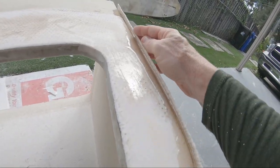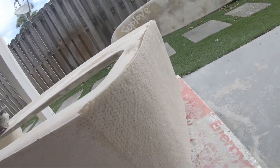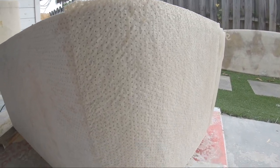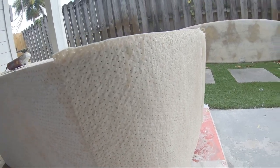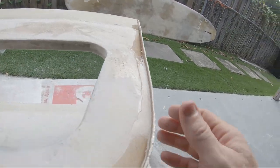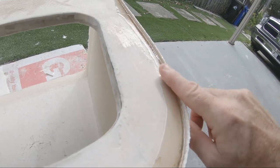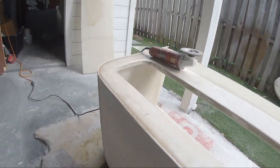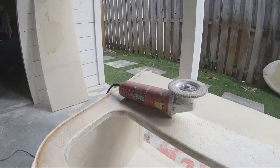The next day I finished putting the core mat on the side. You can see it makes a nice radius and covers a lot of the imperfections in the original biaxial layup. This transition will be nice and smooth. I extended the lip up a little bit and back-poured some resin to make a nice 90-degree angle. I still have both sides to do and I'm about to use the flap disc to grind this flush.